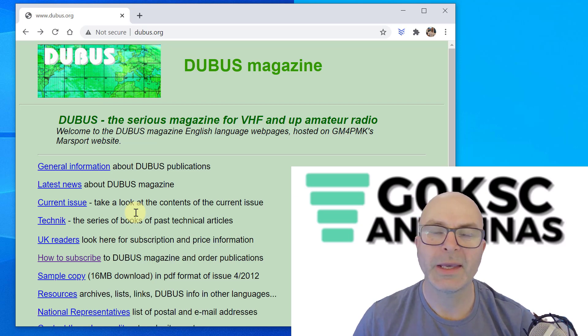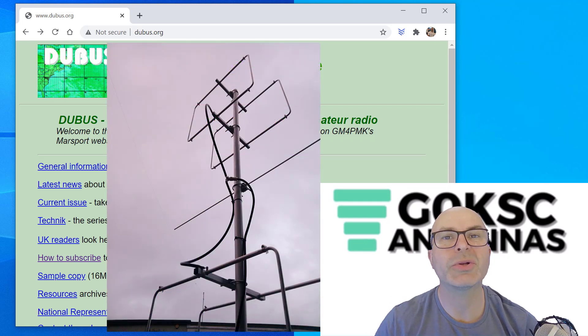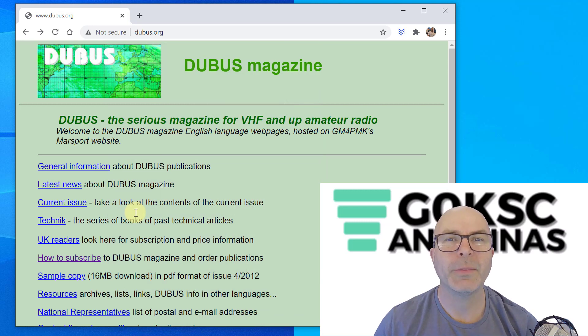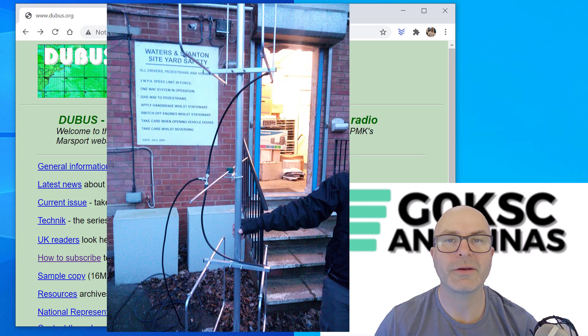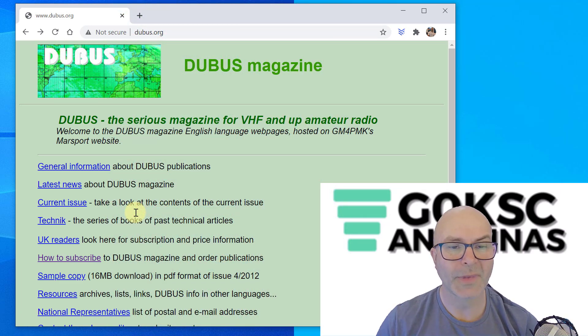It's fairly simple with a single antenna, but once they're stacked either vertically or horizontally, feeding the individual antennas in different places can have very good effects. The most simple case is stacking one above the other. However, if you feed the top antenna at the bottom of the loop and the bottom antenna at the top of the loop, that leads to pattern symmetry in the horizontal plane — which you don't normally get with a quad. It also gives a very hard front-to-side ratio, very suppressed, and the coax lengths required to join the two antennas together is drastically reduced.